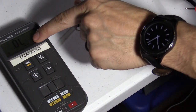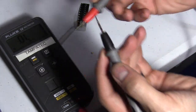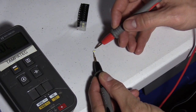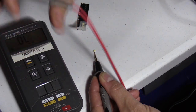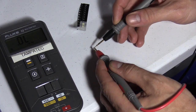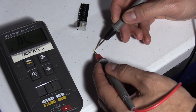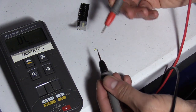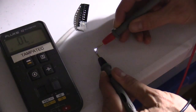Using a multimeter, put your meter in diode mode — you see that little arrow — and with the positive and negative probes, test each side of that diode, which is the LED (light-emitting diode). Touch the cathode and anode and it should turn on the LED. It should say OL on the screen one way, then 0.7 when you reverse the leads. If you hear a short signal tone when you touch it, the LED is shorted and bad. If it reads OL both ways, it's open — also bad. That's how you test it.